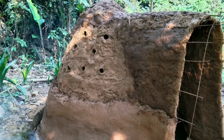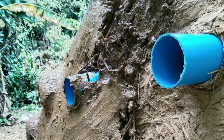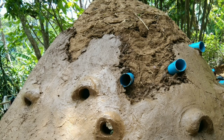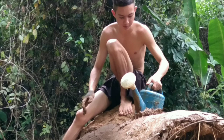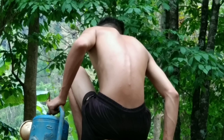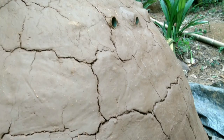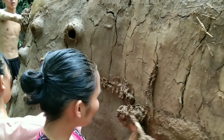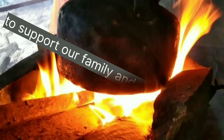Here another time the little windows, and here you see the cob coming up and getting up. Of course these pipes were cobbed in so that they have a kind of an eyelet, which you can see here, and here's the Wattle and Daub, where we can sit on without any problems. We had a problem that we could not get straw fast, so we worked in the time when it was already hot, so it cracked a bit.